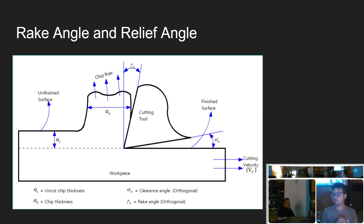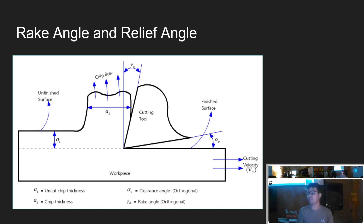Two or three thousandths is perfectly okay, and you can go much higher on bigger tools and workpieces. I've seen chips thicker than an eighth of an inch — but less than a thousandth, you will have a problem; you're not really machining at that point. I'm generally talking about metal in this class since that's 99% of industrial use. Plastics are so easy to machine we don't even think about it. Wood is its own art — it often makes dust rather than chips, but on our ShopBot wood CNC router, I still try to keep to about a thousandth of an inch chip thickness.